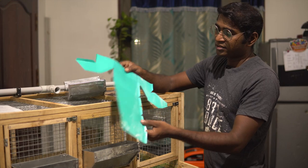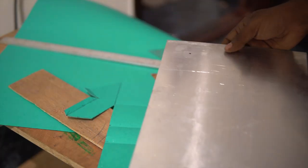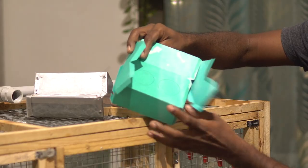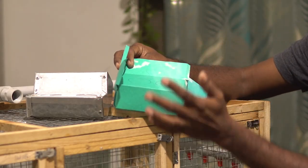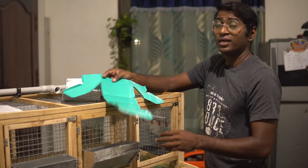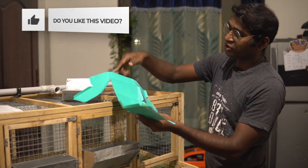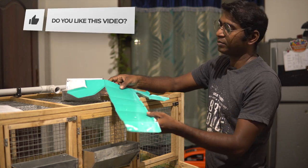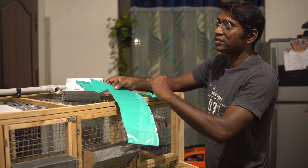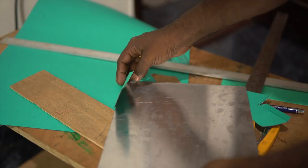To start with, I made a template on a chart and this can be transferred onto sheet metal. Once you start folding the sheet metal, it takes the shape of the feeder and you will have to make some holes. It's better to make the holes before you start folding. There is no reason why one should not be able to make the entire structure using a single piece of sheet metal. But I did not use this template because I had a lot of 1mm thick aluminum sheet metal and none of them matched this size.